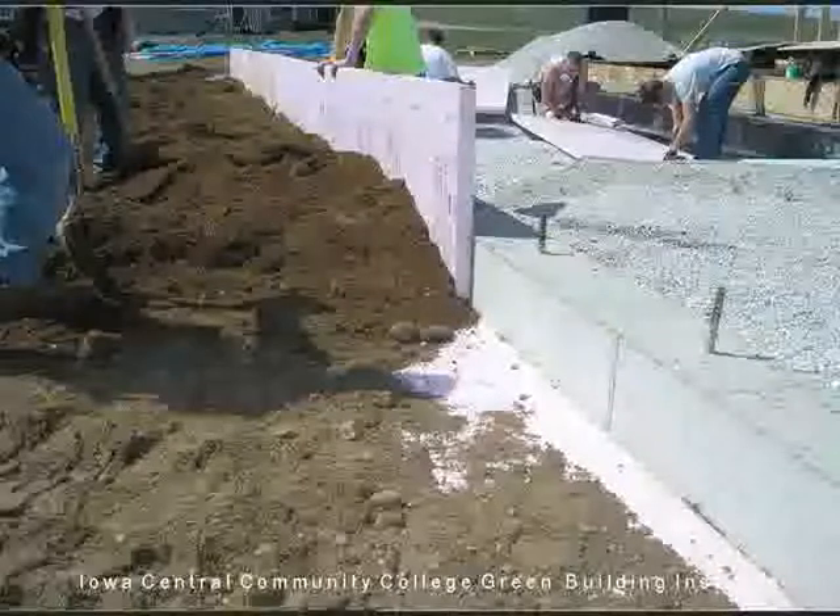Theoretically, you can go two feet. I don't mind putting the extra two feet out there — it's a lot easier than cutting anyway. Then we have two-inch foam on the outside. You pour your slab. This particular slab was designed by Iowa State University. We had two inches of foam underneath it because we stained it a dark brown color and had a lot of south-facing glass.